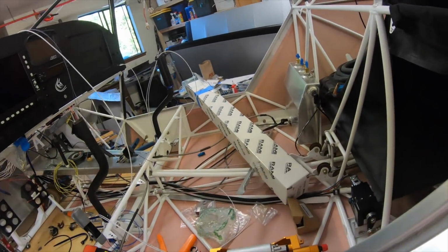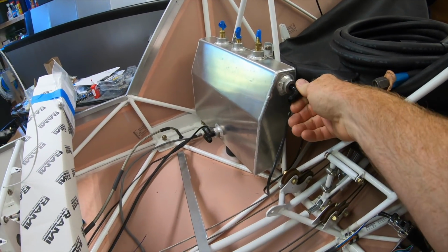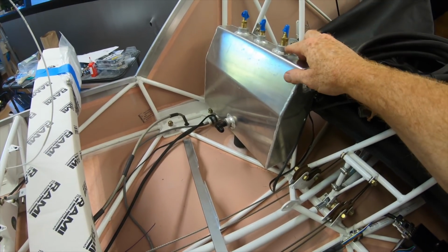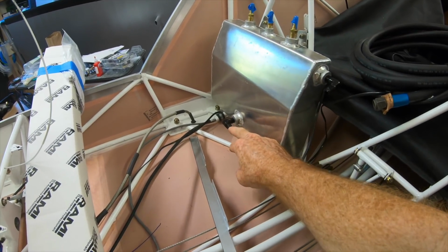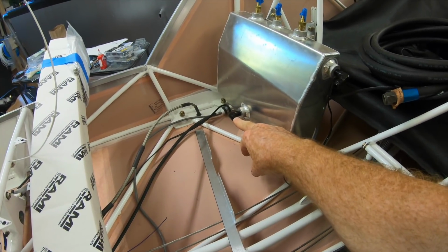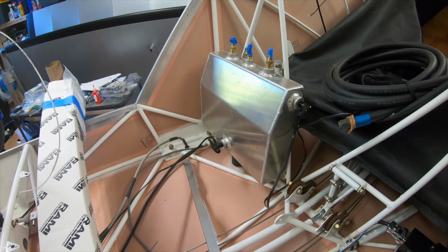Alright guys, so I'm starting in on this fuel system now as the next project. So to track down the proper 6AN fittings for this, but they're all 1/4 inch MPT thread. So if you're trying to size whatever your fitting's going to be on the outside, it's 1/4 inch NPT to, for me, 6AN or -6s. And that's going to allow me to use the 3/8 fuel line.